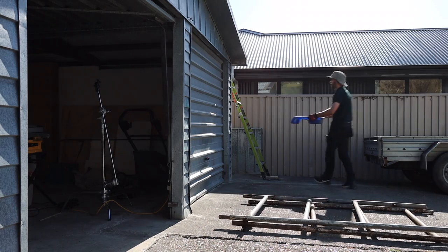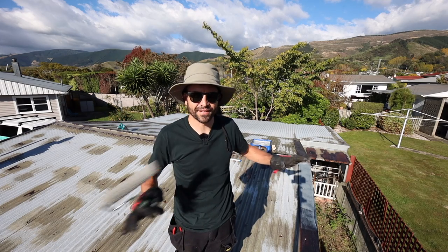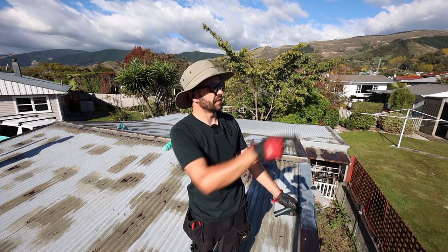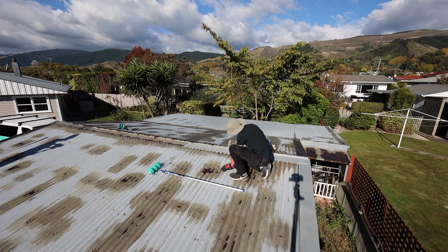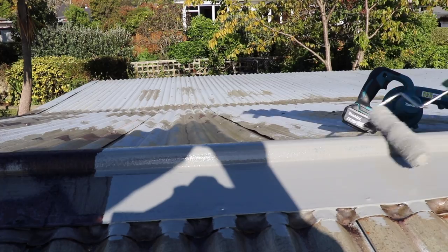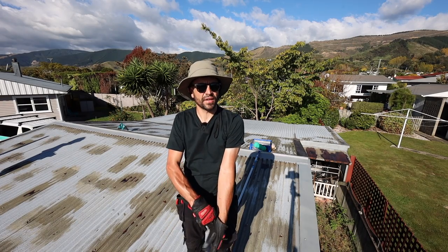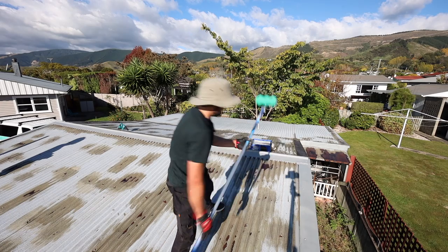Much tidier than I thought. Although this is just a shed, it's pretty typical of New Zealand houses — my house has the same corrugated iron roof as my shed, no different. When I look around here right now, pretty much every roof I can see is corrugated iron, just like this — maybe one concrete tile roof but mostly corrugated iron in New Zealand. So there we go: rust converter acts kind of like a primer, and then I'm adding this additional primer on top. This roof should be pretty invincible. Hope you've enjoyed this episode of Scott Brown painting — in the next episode I'll probably use some timber again.